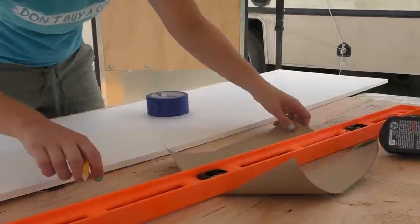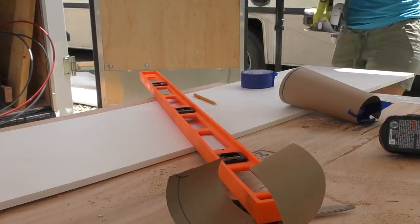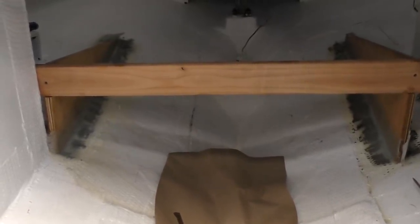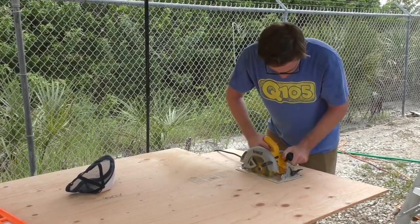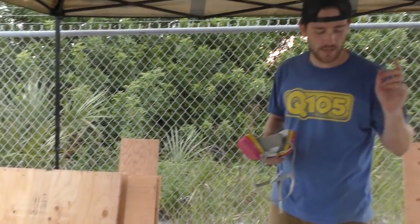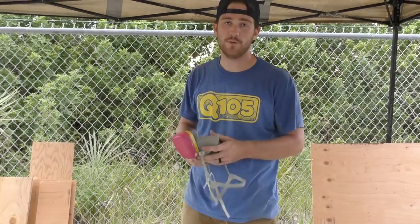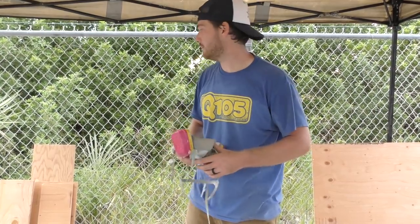We'll show you more of Jordan's battery bank holder — the battery platform — in a little bit, but I'm going to cut another piece for that shelf. So there are the supports for the battery platform, all fiberglassed in and ready for the battery box to go on top. We got the pieces of the battery box cut and we have extra epoxy prime coat that we used for the deck, and we're going to paint the box with it to completely waterproof it. We're using marine grade plywood as well — just a little extra step to make sure no water is going to damage it.